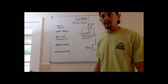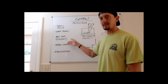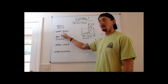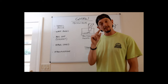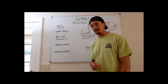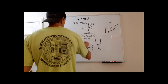Now let's cover the things you control while welding that affect weld appearance and quality. Just like any other process, there are basically five variables: your two angle types — travel angle and work angle — your arc gap (called stick out in MIG welding), your travel speed, and any manipulation or oscillation you're doing. We'll go through each one.